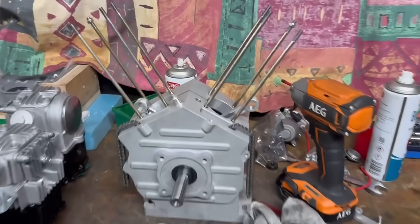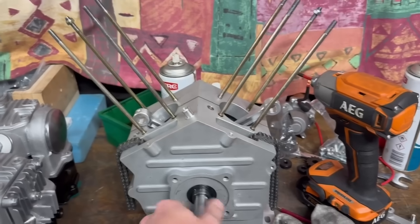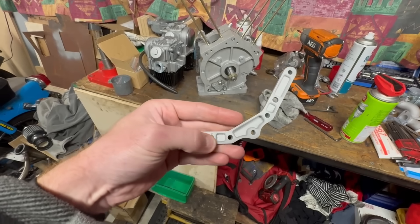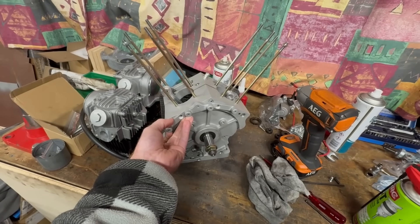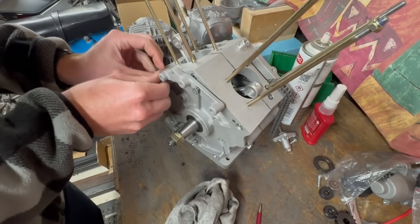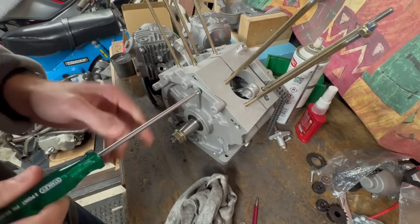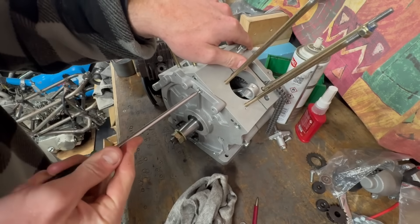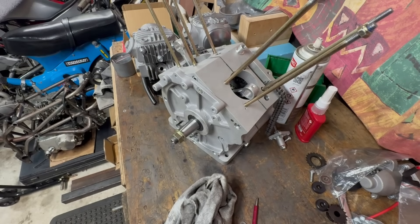What I've got to do is put on the base gaskets here and here, and then place on the cylinders and ensure I get the timing correct for the cams. We've got this awesome 3D printed aluminium piece that goes on here — its job is to hold the ignition coils. The holes still need to be drilled and tapped M6 for the coils. I was too chicken to print the threads in there — I know you can print threads into 3D prints but I thought I'd save that and just tap them by hand.